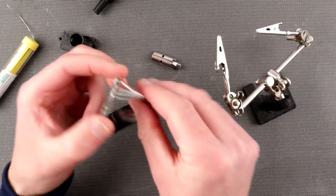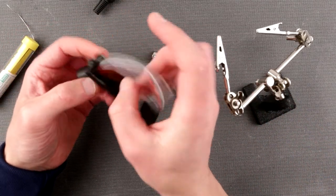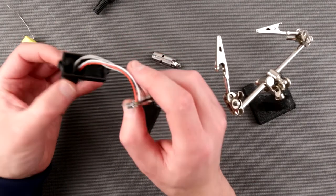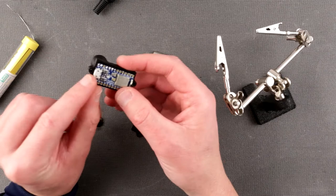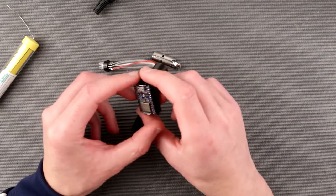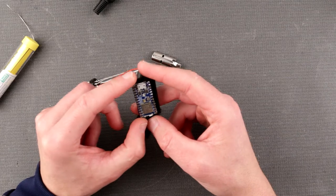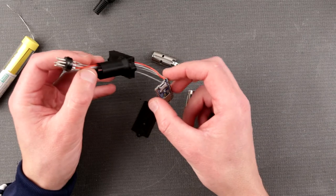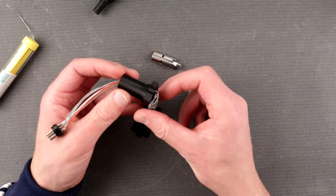So we have it all soldered. And now, before you do that, make sure you have programmed your microcontroller, because what may happen is that if you place it right here, you won't be able to access the USB port. So make sure you program your microcontroller first. Mine is pre-programmed, so we can just put it all together, but make sure you program it first. Or you can program it at this stage. But when you connect it to the Bescor, please do not program it while it is under power from the Bescor. It's going to cause some confusion.